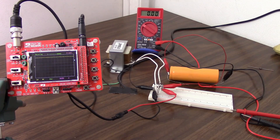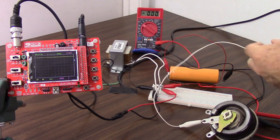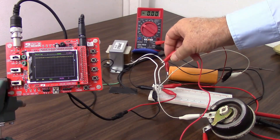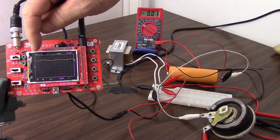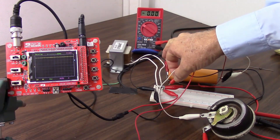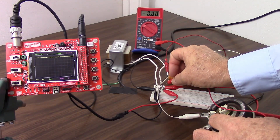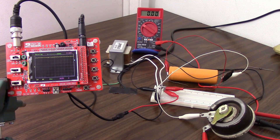If I look at this with the meter: 15.9 volts — looks like a slightly lower voltage, but there we have our steady 16 volts. Now let's see what happens when we load this down. Hook up my lead to go to the negative side of the capacitor — the load goes in parallel with the capacitor. I have about a 12 ohm load. And that's what happens on the oscilloscope. As you can see it's not going down as far, even with that high load — and it's not going up as far either, but we have our ripple. Our voltage doesn't go down as far because we have more energy with the full wave rectification. Our ripple is not going down as far in voltage, so we have less ripple and a higher average voltage if we use the full wave rectifier.